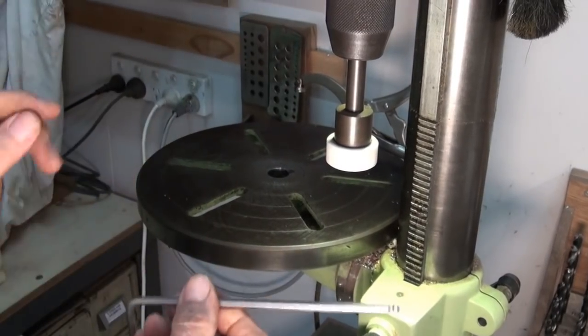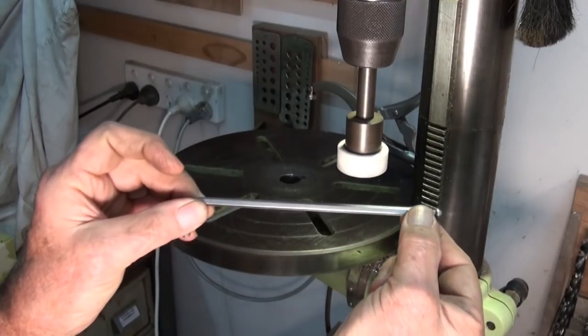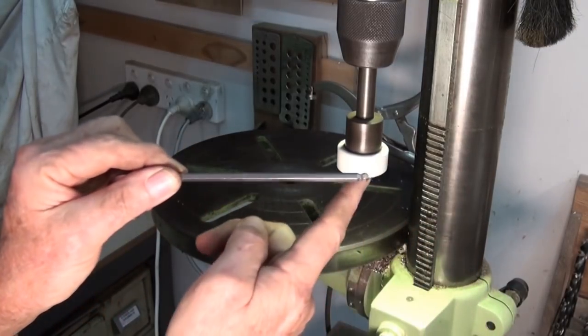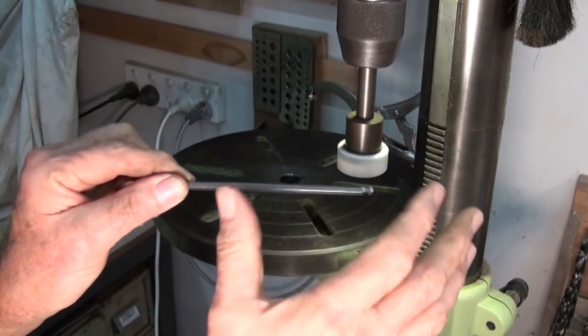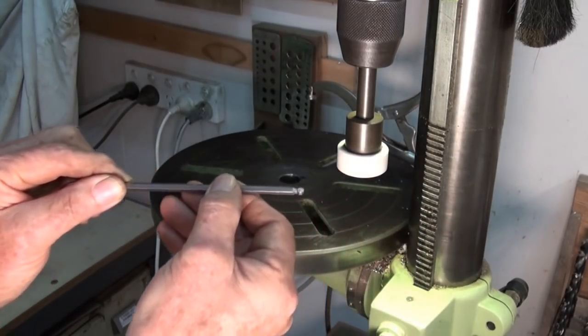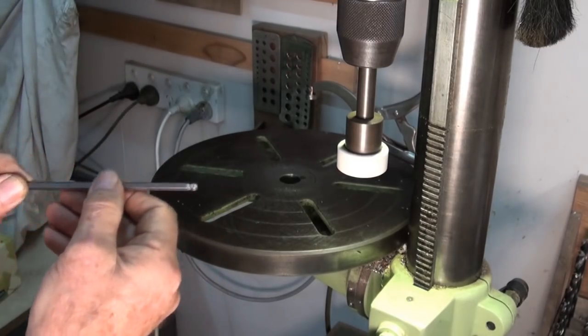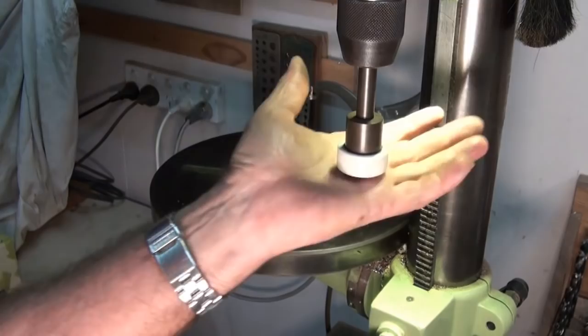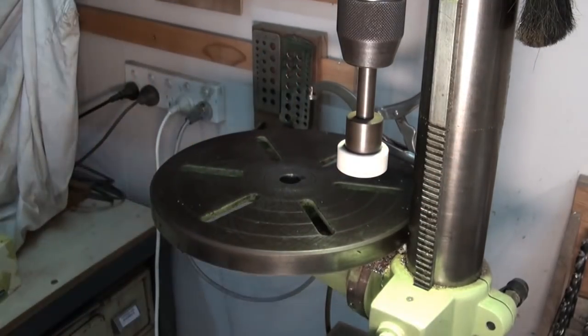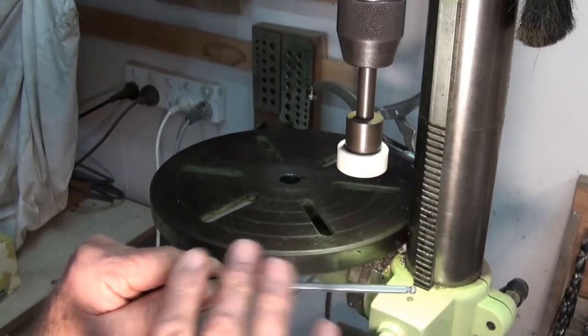What's important here is that as you withdraw that tool and you're just starting to leave this surface, you'll actually feel the magnetic pulsing. You've got to just keep going, keep going, keep going — pull it away at least a foot, 300 millimeters — and then don't bring it back inside that magnetic field again. If you do that, you effectively neutralize whatever magnetic poles you have in the tool.